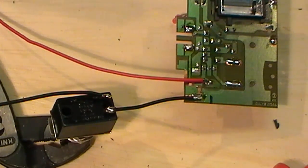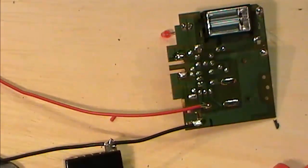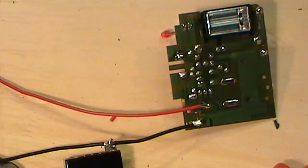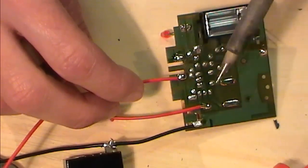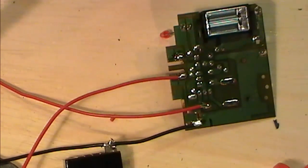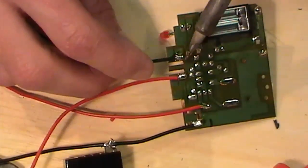I've got a couple of wires that I'm going to tin up and add across these terminals here. Now these two here were, if you like, the little touch switch which activated the flash. So just bear with me while I tin up my pos bit. And realistically with these it's not going to make much difference which way they go round. But what I'm doing, I'm soldering it up to the switches as I'm going.